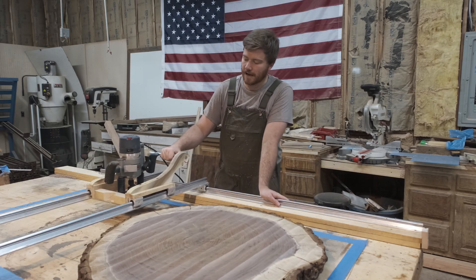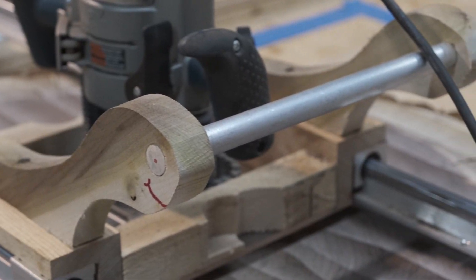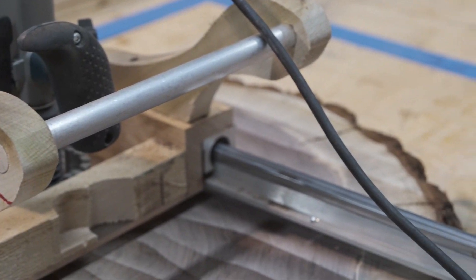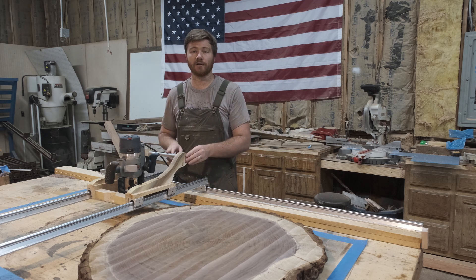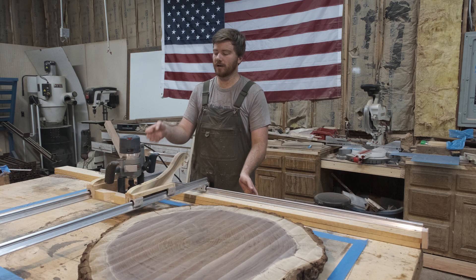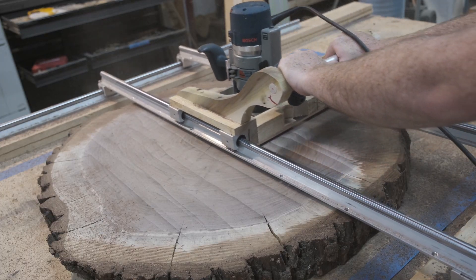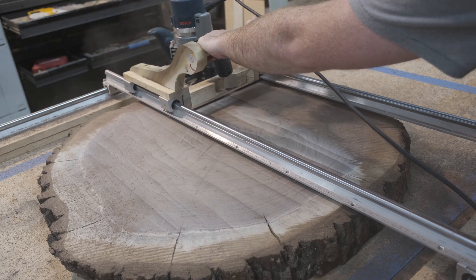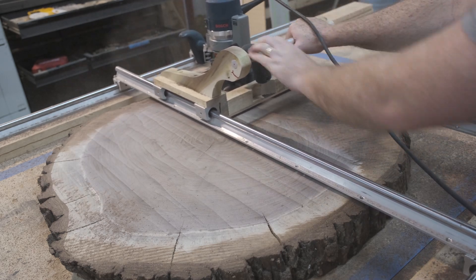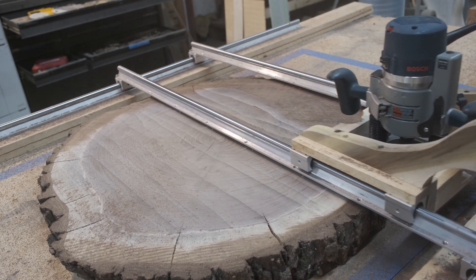The first thing I added were these two pieces of wood — I just cut these out on the bandsaw real quick — and then this three-quarter inch piece of aluminum bar. I would have used a dowel, but I only had aluminum bar in my shop. I put this on to turn the motion from a pistol grip of my Bosch router into more of a pushing motion. This actually helps a little bit when you're trying to cut something further away — you're not feeling like you're reaching over the table as much. This has definitely helped me out a ton.